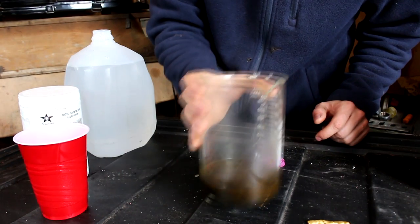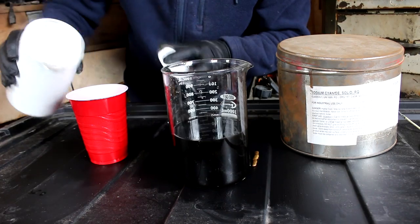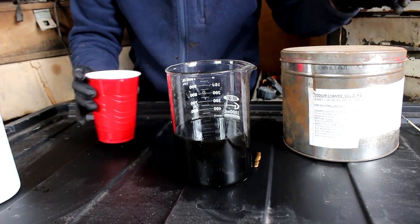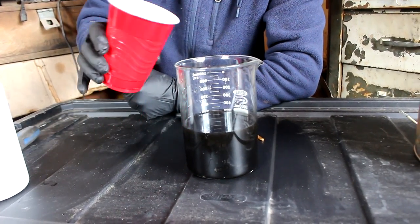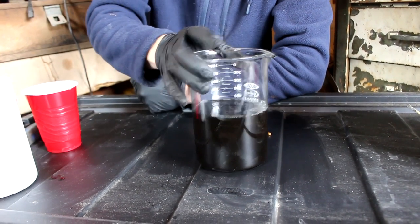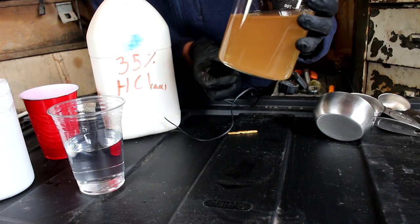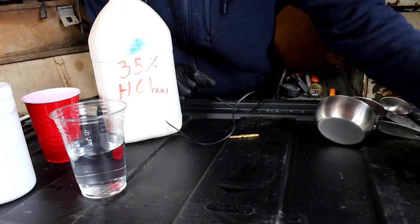There's the gold hydroxide forming — it should be a brown powder. Now that I've got this solution neutralized and diluted, I'm gonna add a little bit of sodium hydroxide to make a very caustic solution with some sodium cyanide. Cyanide will dissolve the gold hydroxide into gold cyanide, which is soluble. Now I'm adding the sodium hydroxide cyanide solution to the gold hydroxide — hopefully that goes clear. It's definitely going clear, you can see it changing color, though it will take a little bit. It does produce some amount of metallic gold as the cyanide reacts with the hydroxide, but the metallic gold should dissolve over time as oxygen mixes into the solution.